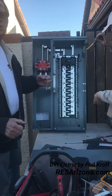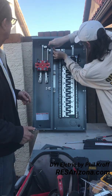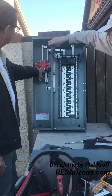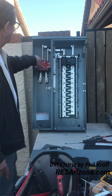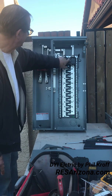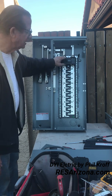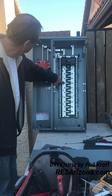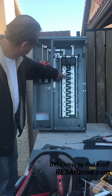When you go to a sub-panel, you have to separate them, and that's so nobody gets shocked off that ground wire. The power comes in here — there's a space behind here — and then the power goes from here. The linkage goes up, across, and down, feeding into this breaker. When the breaker is on, it feeds down and hits this alternating bus. You have one bus that's every other one of these, and the other bus is the opposite phase.